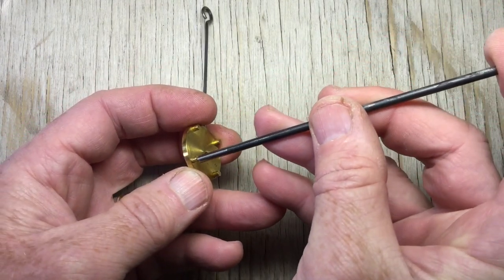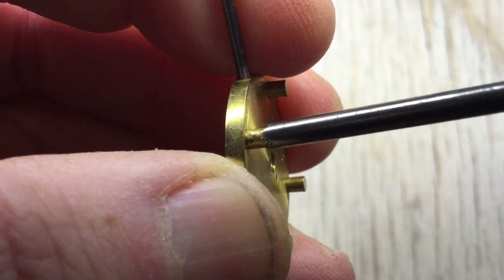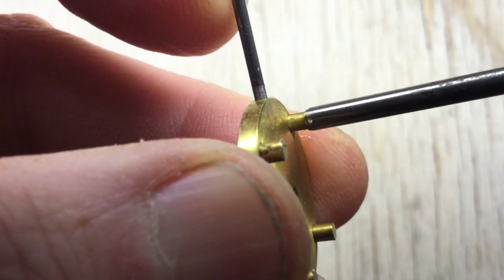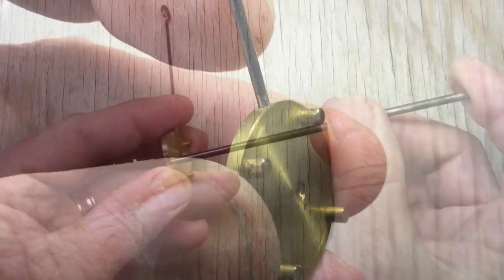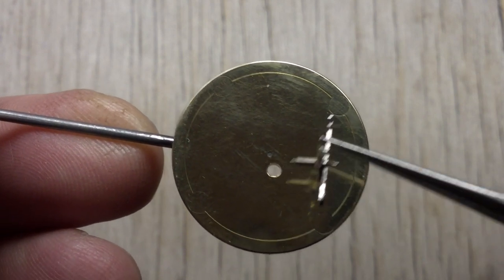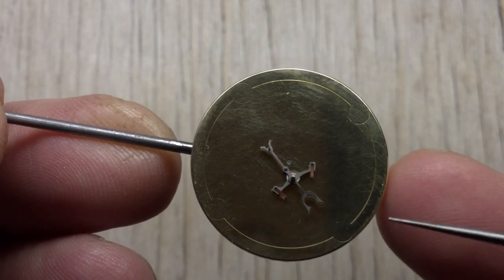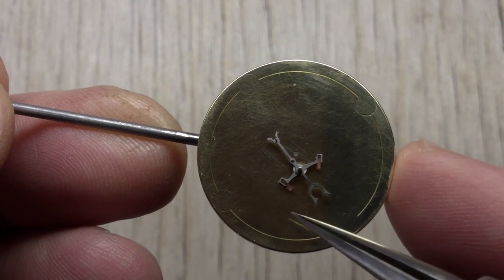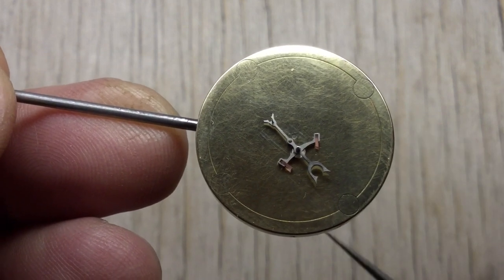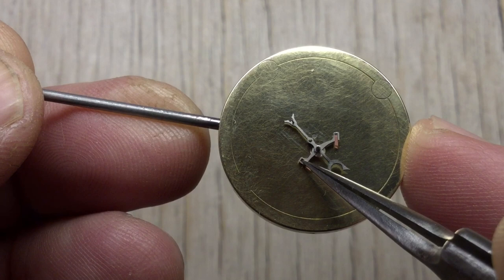The chamfering tool is used like a watchmaker's screwdriver — the sharp facets shave off the brass. To use the pallet warmer: the item with the jewel that needs adjusting is placed on the table. If it has an arbor, this is put through an appropriate hole to keep the piece flat. A small piece of flake shellac is placed on the table near the jewel, then the table is warmed over an alcohol flame. When the shellac softens, the bond holding the jewel has too, and the jewel can be adjusted.